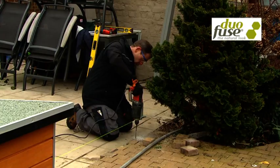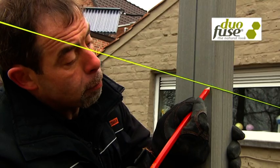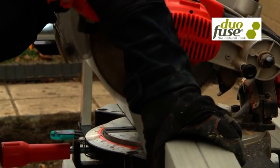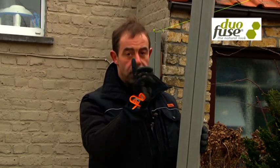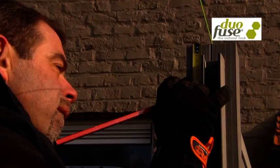The second post of the fencing will also be mounted on the patio. Therefore, I mount a stainless steel fence post support with a base plate along the line mark of where to level the posts. The post itself is made of wood composite, but inside it's reinforced with an impregnated wooden core attached to the post with a screw at one end. Any alterations to the length of the post must be made from the opposite end where the screw is attached. I put the side with the screw into the fence post support and attach it securely, ensuring that the impregnated end of wood remains sealed.